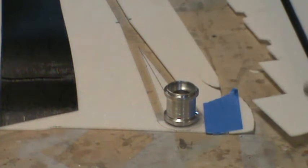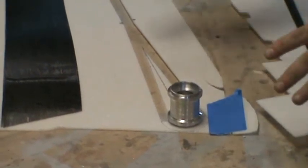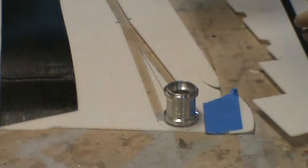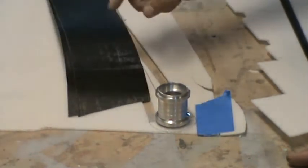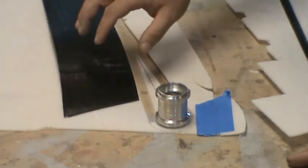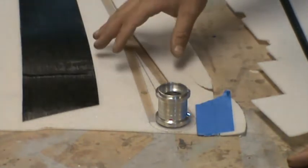Like I said, I've done some pseudo CAD drawings and kind of tied all this stuff in. I've done just the spar caps and everything, and the way I've got the spar set up with the shear web and the spar cap, the same width, thickness, same material and everything, the wings should hold up fairly well. And this unidirectional cloth I'm planning on using is actually heavier than what I originally planned on using for the wing. The reason why I'm using this is because I've got it, and on this prototype wing it'll save me a little bit of money.